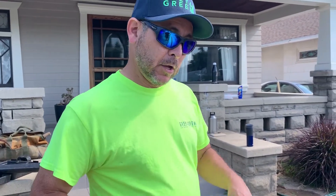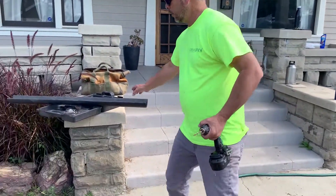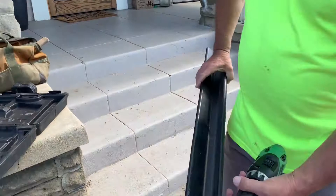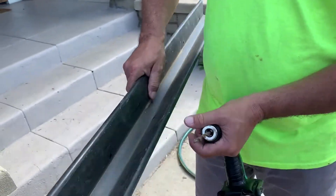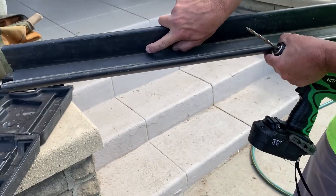What we're going to do now is actually drill holes into the aqua pipe. We're just drilling in the inner wall, because within the inner wall that allows the water to seep through the pipe itself. The gray water is going to flow through that inner channel and then seep out through these holes that we drill.